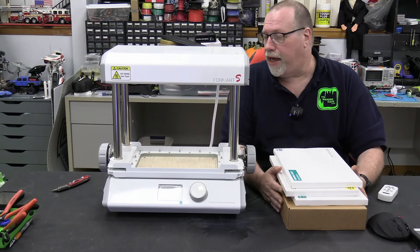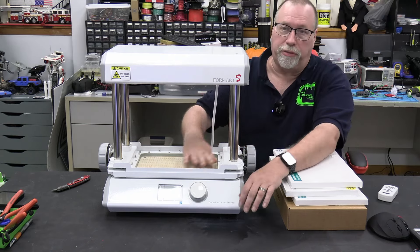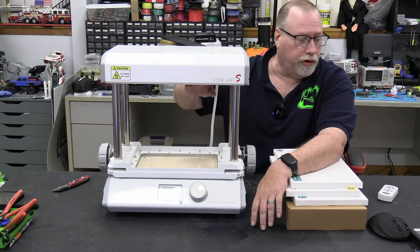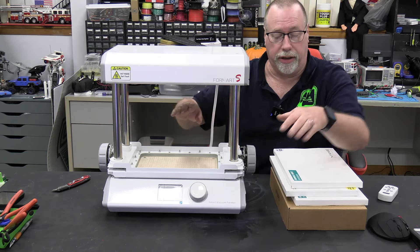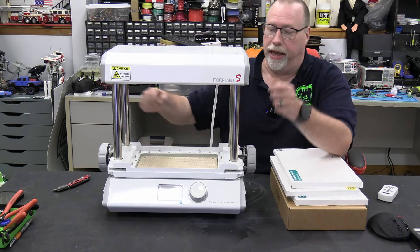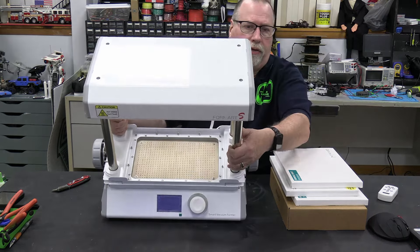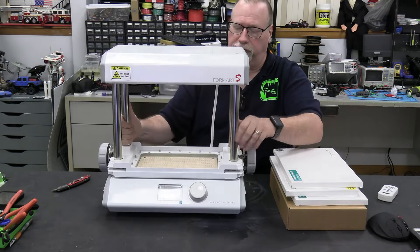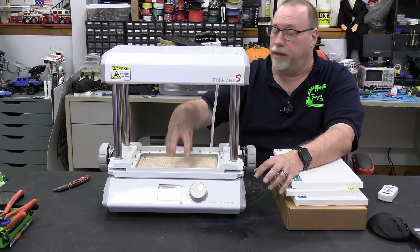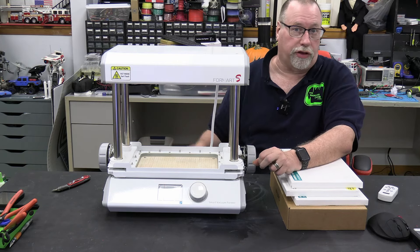For those who don't know what a vacuum former is, basically it's a big vacuum where you put a sheet of plastic in. You bring it up to the heater, which is usually up top — which it is in this one. It's usually a styrene or PET plastic sheet. It warms up and gets really soft, starts to sag. Then you bring this down, turn on the vacuum. There are tiny little holes in here so the vacuum can suck the air down and that plastic conforms over whatever shape or buck you have in here. That's kind of like how they make blister packaging for scissors.